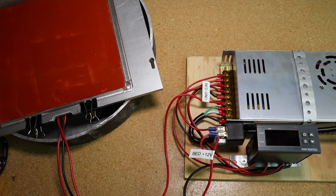Removing a surface mount resistor turned out to be surprisingly easy. Once again, I did a search on YouTube and found a channel where someone was demonstrating exactly how it's done. The channel was Curious Inventor. I'm including links to all these various channels that I'm relying upon in the description below. So I swapped out the 10K resistor on the board for a 100K ohm resistor, and it works.